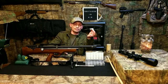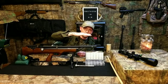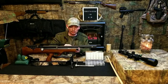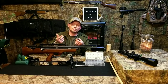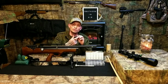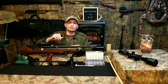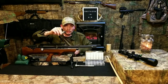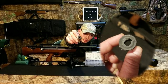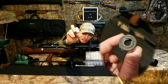The pellet didn't leave the barrel spinning perfectly on its axis, and traveling through this small hole with only 30 thousandths of an inch of clearance, it didn't take much — it clipped the last baffle. Whether it was lack of energy and gravity pulled the pellet down and it just clipped this last one, I don't know. It didn't clip the end cap and made its way out, but that little tick of the pellet skirt on that last baffle as it traveled through broke it. You can see the small hole in the center of the baffle got clipped and the baffle broke.